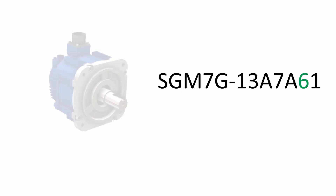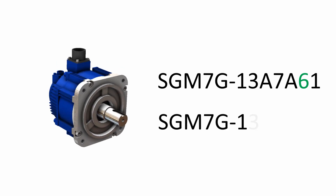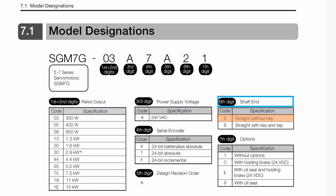Okay, let me think. It happens sometimes — we are human, sometimes we make mistakes, blunders. Maybe while ordering the motor we made a mistake in specifying the model number. For example, a single digit mistake in a servo motor model number can result in a motor without a key slot — a straight shaft without a key — or maybe for any other reason.